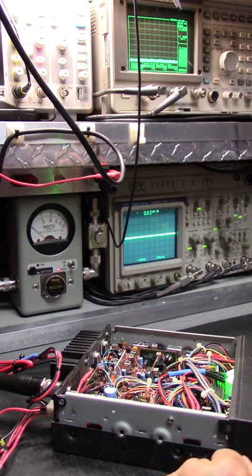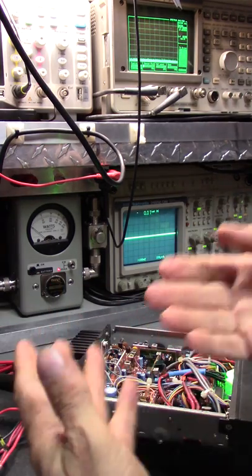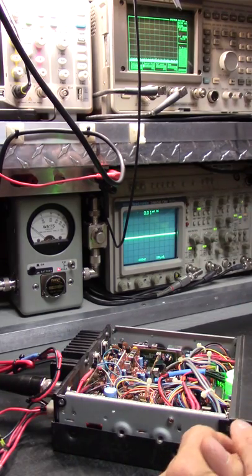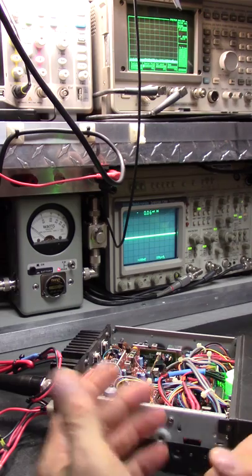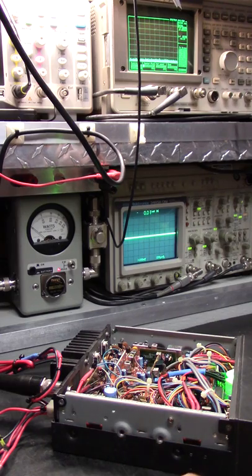First, I'm going to let you see what a low level modulated radio looks like, like one of these, unless they're modified again. It seems like people get it all mixed up. Well, this radio swings, this radio swings that. Then there's Ohm's law, and then there's this flaw in Ohm's law when you're talking about RF. There's no flaw. It's understanding why there's a variance, and that's basically due to high and low level.